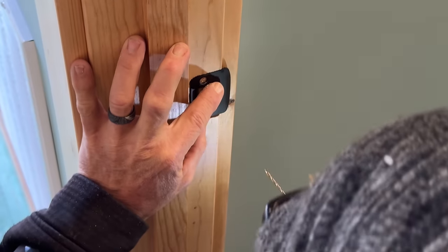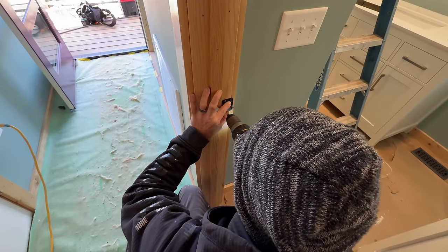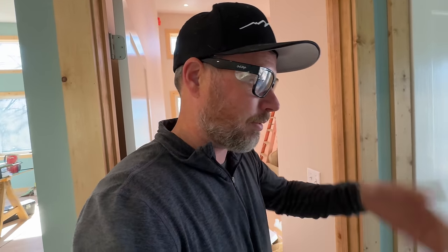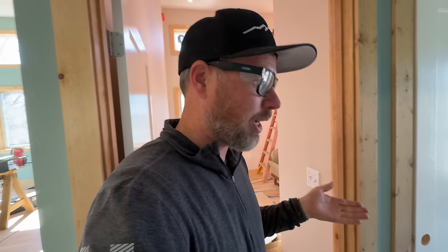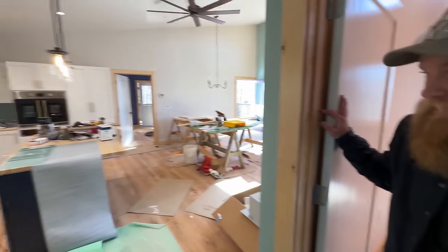That did it. The reason we're doing all this fidgeting around with the catch plate is that the door won't shut properly if you don't do this precise work. I've had so many doors in houses I've bought where the door didn't even catch — the latch totally missed the latch plate, or it was really loose or too tight. It's not a matter of just bolting this thing in exactly where it looks like it should go — there's a lot of fine-tuning needed to make sure each door works as perfectly as it can. The door I'm working on — everything lines up. You know who hung that door? It was me.